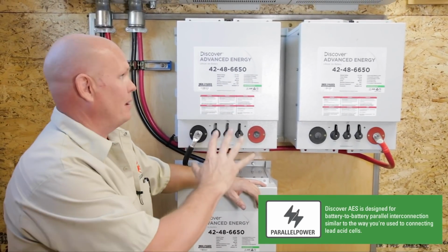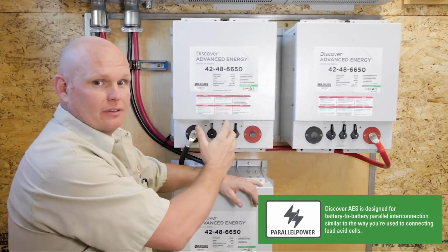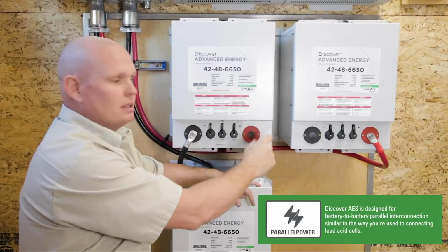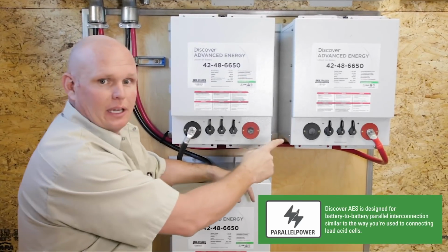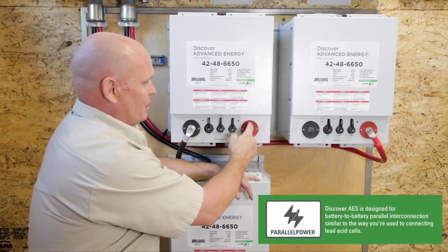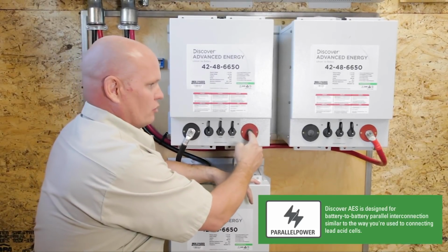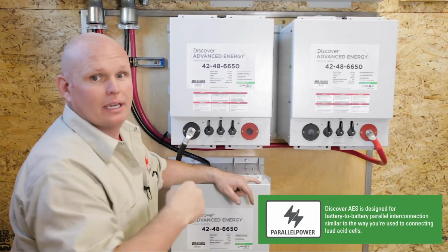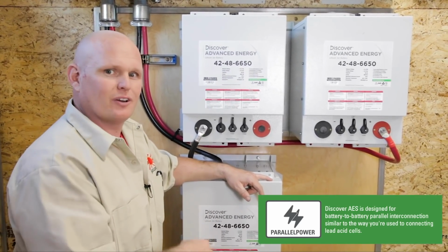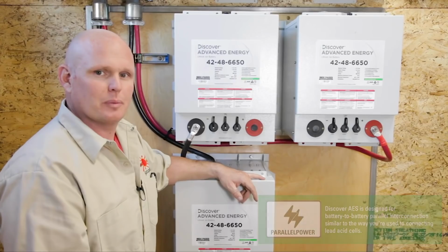One of the nice things about the bracketry that you get from Discover Battery is it places the batteries the same distance apart every time. This is gonna allow for rapid duplication of parallel battery connections if you're gonna have more than two. So you're gonna be able to figure your distance from terminal to terminal and mass duplicate these cables even before going out to the job site. We're only gonna have to make two for this job, but it should be pretty easy.